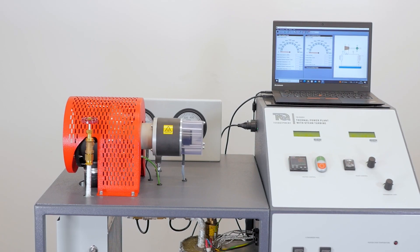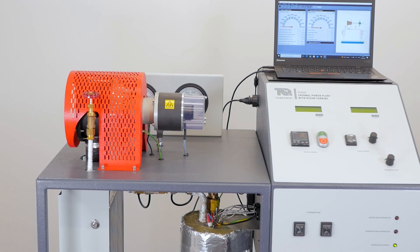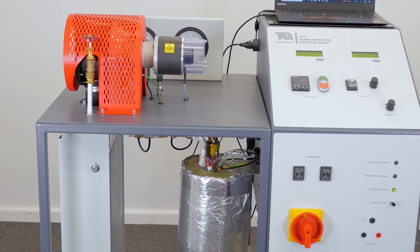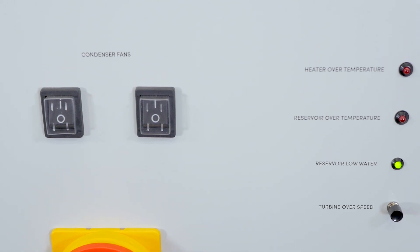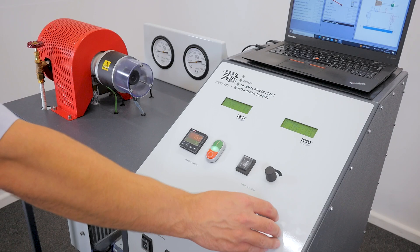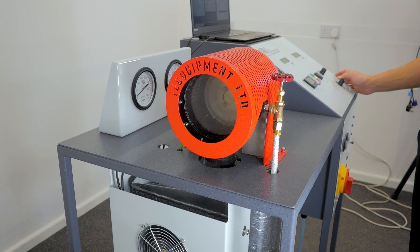This piece of teaching equipment is designed to give your lectures an engaging and practical aspect. It features a flash boiler design that quickly goes from cold to experiment ready in 7 minutes, thanks to precise thermostatic controls allowing immediate practical lessons. It offers variable flow water feed control allowing you to adjust steam production as needed. Notably, it can display mechanical power and generate electrical power with variable loads, making it versatile for various teaching needs.